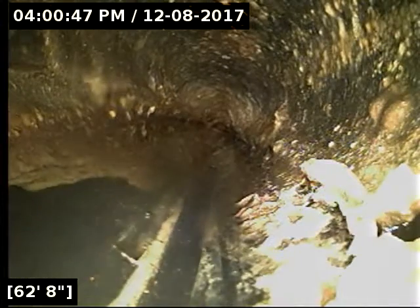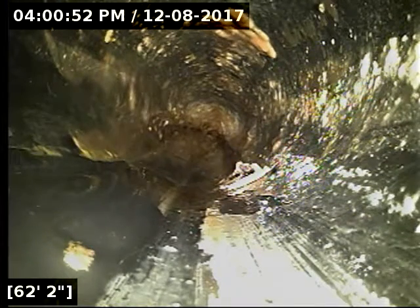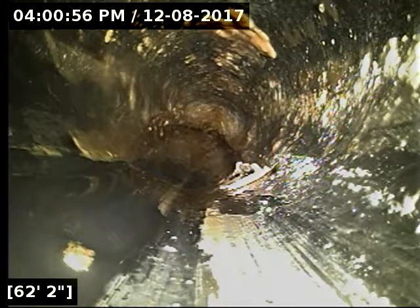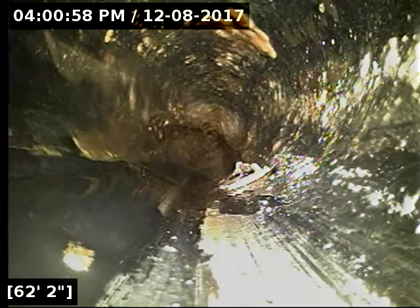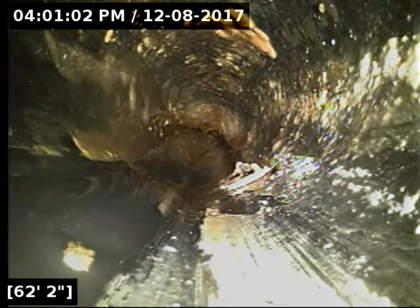You can see it goes all the way up to the top of the pipe — so you've got a three-inch line with three inches of standing water in it. This causes all that debris to build up. If you accidentally get a wad of toilet paper, paper towels, or continue to put grease down the pipe, that stuff will build up in this spot like crazy and can cause a blockage and a backup. I do recommend correcting it.